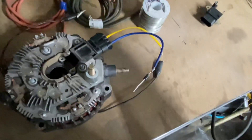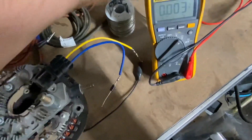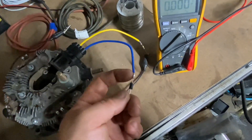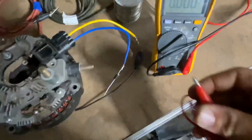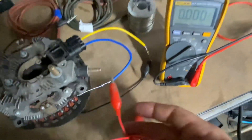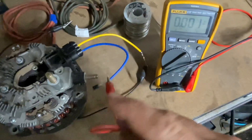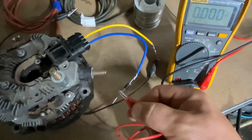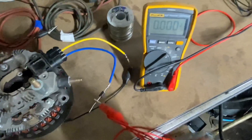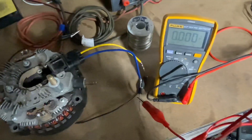I'm going to take some test leads, take this harness out, hook it up to my Yukon, and we will monitor the voltage to show the difference. What I'll do is connect back where the diode isn't in place and show you the voltage with the vehicle running, then move it down to where the diode is actually in place and we'll watch the differences in voltage.